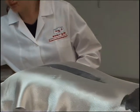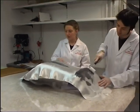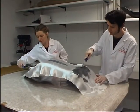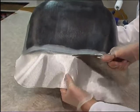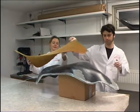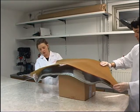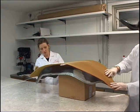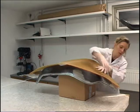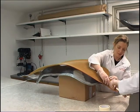The additional glass fabric ply reinforces the overlay and functions as a coupling layer. When laminating the transparent glass fabric, the uniform application of resin can be easily identified. This is very important if the honeycomb core and overlay are to adhere well to the entire surface of the component. Excess glass fabric is trimmed with the offset scissors. To achieve adhesion between the honeycomb structure surface layers and core, the additional glass fabric ply has been laminated with excess resin. The honeycomb core has been trimmed precisely and must be secured in place with adhesive tape to avoid dislodging before placement into the vacuum bag.